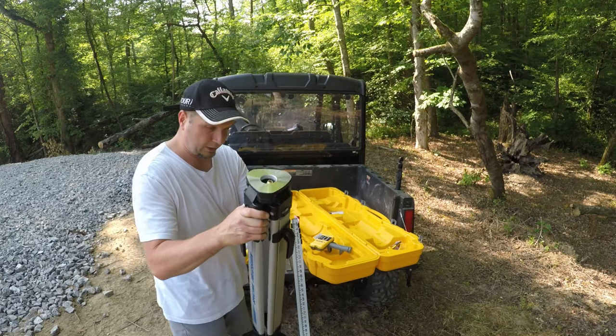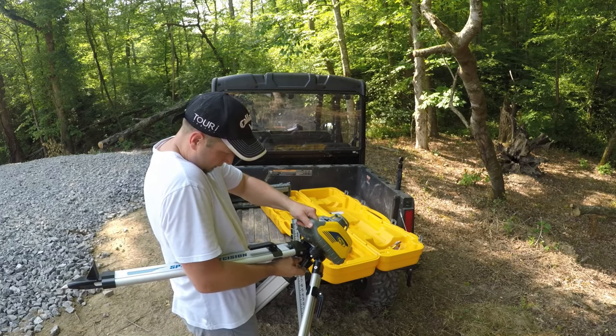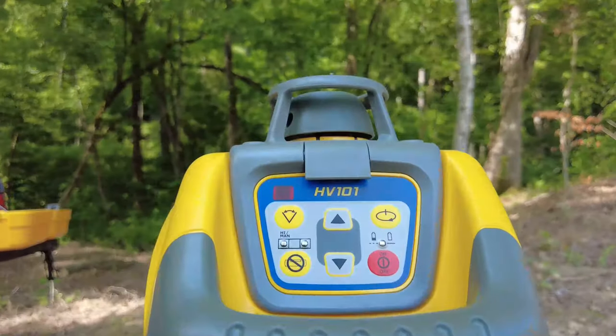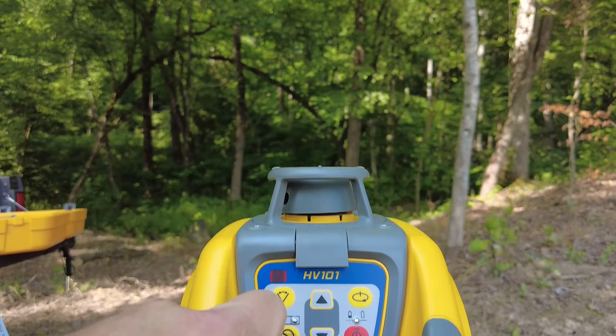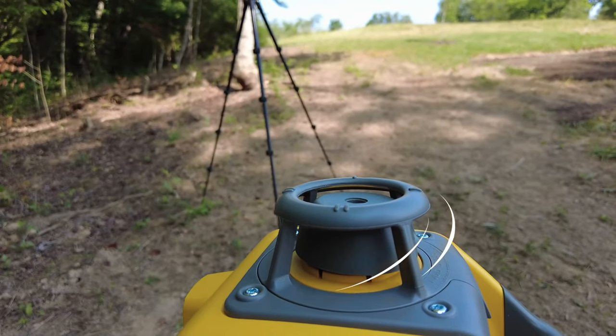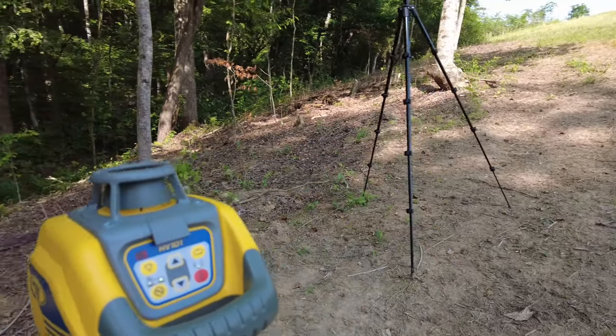We're going to mount it on our stand and attach it. When you're setting this up, you don't want it to be in the way of anything. Now that we've got the laser level in the ground and attached, I'm going to show you the screen display. We're going to hit the on button and it's going to start ramping up. At this point it can take up to five minutes for it to get its level set. Once it gets its level set, the unit starts spinning, throwing out a beam, and then we'll take our laser receiver over there and see where we are. It's actually just started spinning — the unit is now spinning, so we're ready to go.